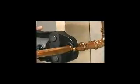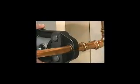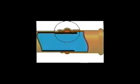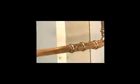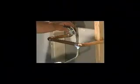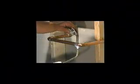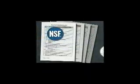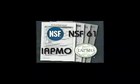Let's look at the connection itself. A ProPress connection provides a strong, reliable, watertight seal. The high-quality, high-strength connection, when installed properly, will last the life of the tubing system. This reliable connection is double crimped in front of and behind the seal. It's a better connection and a better looking connection. ProPress results in a more professional appearance because there's no buildup of solder or tarnish. ProPress is more friendly to the environment because there is no lead-based solder or aggressive flux used. ProPress meets the most rigorous testing standards and codes in the U.S. and Europe. The system is certified and NSF 61 approved and IAPMO listed.